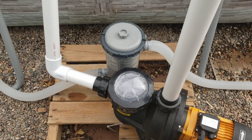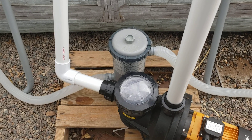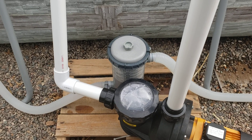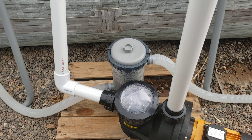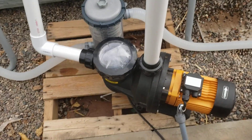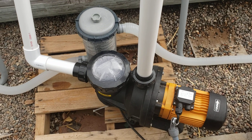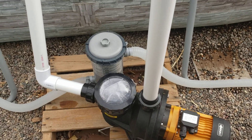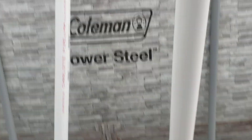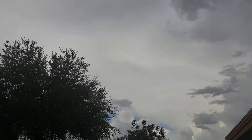You need water inside so you can get suction head once you start it up. If you don't, it'll just run and flow air with no suction. I had to learn that the hard way — I almost assumed the pump was no good. But look at that flow on a cloudy day!